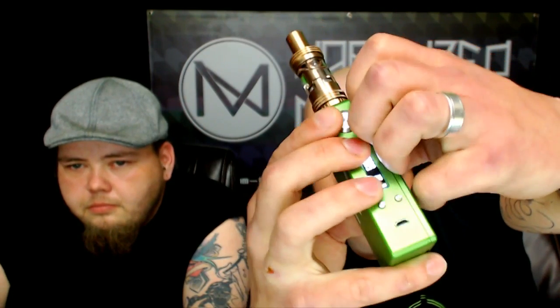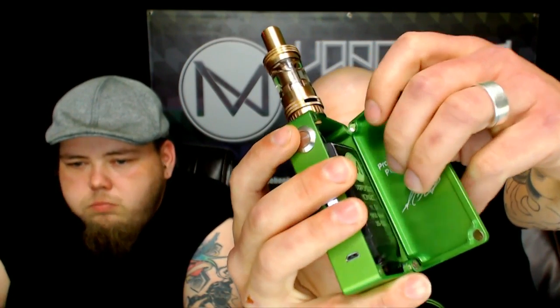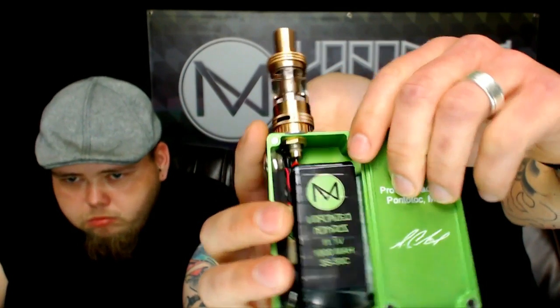Have you got the menu uploaded in that one yet? Yeah, menu's okay. Uploaded in all of them. So we're using a 12mm MyTech switch, which is very clicky. But you are using the onboard DNA switches for the up-down, which will work pretty well. Of course, you got your USB port for eScribe and for charging.